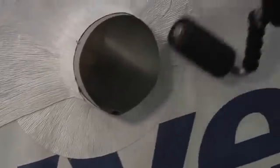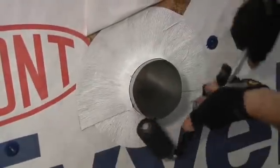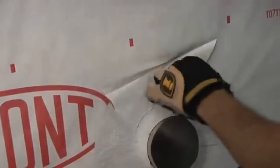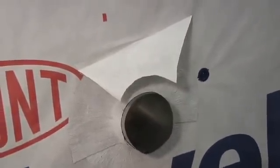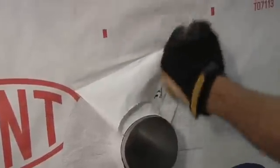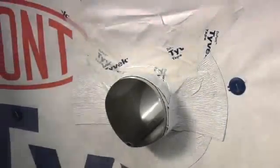I've cut the second one slightly wider so I have a projection out over the lower piece. After the Flex Wrap is installed, I'll use a J-roller to ensure good adhesion. I'll untape that flap and fold it down over the opening. Then I'll put a third piece over the lower part of that flap that I cut. This is how you can use DuPont Flex Wrap to flash most round penetrations.